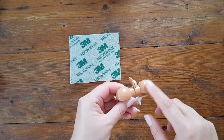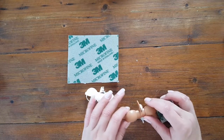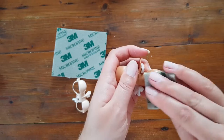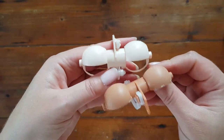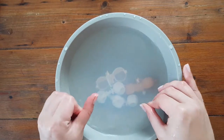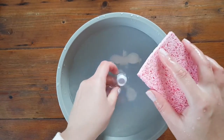We also need to remove the gloss from the eyelids. I use a microfine sponge — something very soft — because I don't want to scratch the surface. The point is just to remove the gloss from the top. Once done, there is no gloss anymore and they are matte. Then I put all the parts of the eye mechanism into soapy water and wash them carefully. We want to remove all dirt and any kind of glue and make everything clean.